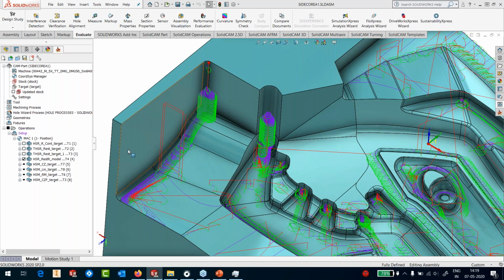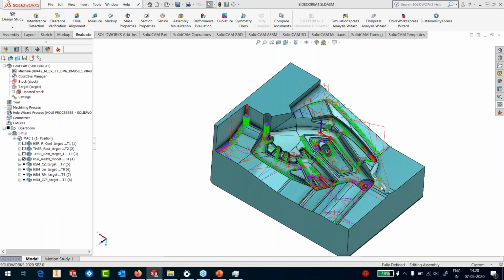Obviously, this length here is 88, 89 millimeters, and we cannot have a 10 diameter ball nose tool sticking out of the holder by 90 millimeters. We are going to create either a very bad surface, or the tool is just going to disintegrate. It'll break, because an L/D ratio of 9 is unheard of in these kinds of machining environments, especially with such thin tools. So what I'm going to do is take advantage of my 5-axis machine.